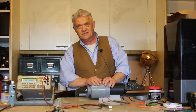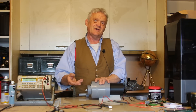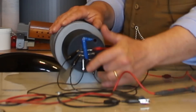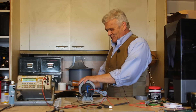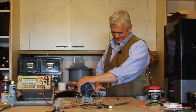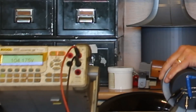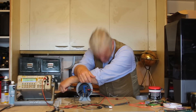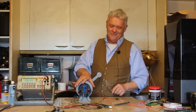I've put this gearbox on — it's a 27 to 1 planetary gearbox, stacked as we saw. What we're going to do is read the voltage out of it by me hand cranking it and see what we get. I've connected it up in series at the back — you can see the series connection. If we crank this handle we should definitely get some kind of voltage reading. We get 104 volts out of that! I'm a bit scared about taking it any higher in case I burn the wires out.